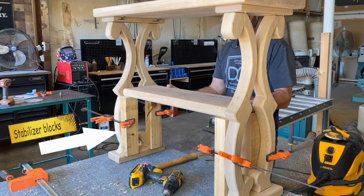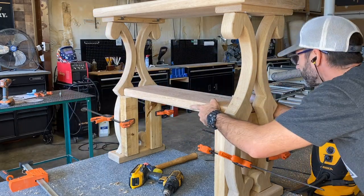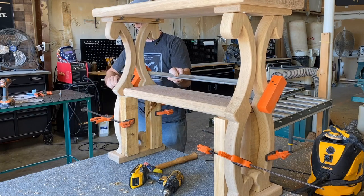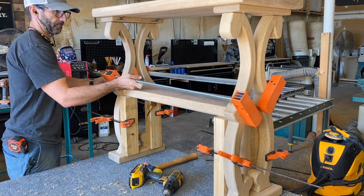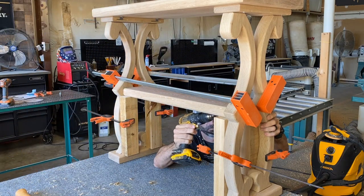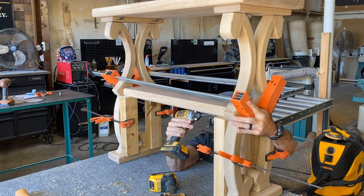Now 90% of the time I would use resin, but since I'm short on time I opted for that option. With this table, this middle shelf I'm actually going to attach with pocket hole screws as I'm not really concerned about seasonal wood movement, but since this piece is for my daughter I can afford to do a trial and error — I want to test and see how much movement there actually is going to be.